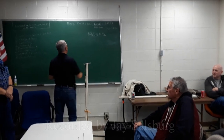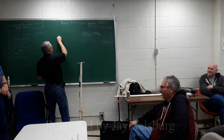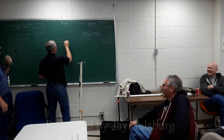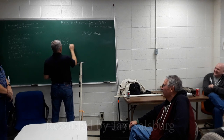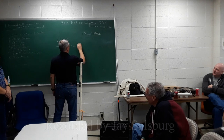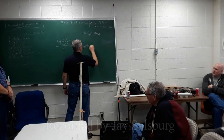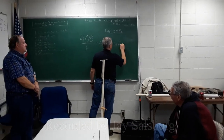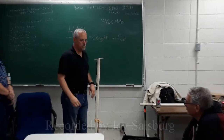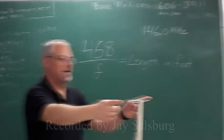What's the formula? Anybody remember? For a dipole. You get on the internet. Tell us. Frequency. Inches. Okay. 468 divided by the frequency gives you the length of this dipole in feet.